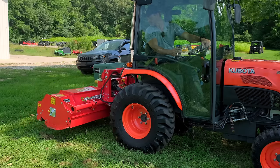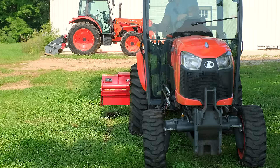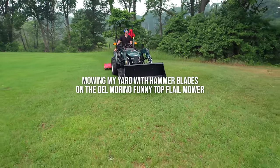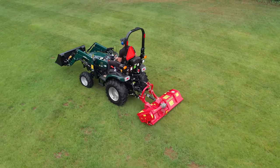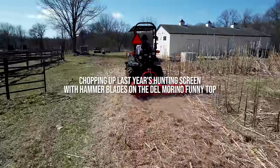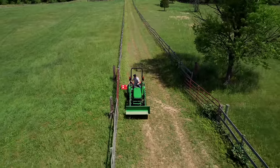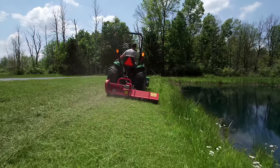One of the big decisions when buying a flail mower is whether to get Y blades or hammer blades — I've done a video on those differences. Traditionally, you'll hear that Y blades are for grasses and light weeds, while hammer blades are for thicker, nastier material like brush and small saplings. But I've found hammer blades work really well on grass too, and if I were going to pick one, I'd lean toward hammer blades — they're more durable and robust. They did a nice job on my lawn, and I know I can still tackle the field and brush line with them. You can always swap blades out; it takes a couple of hours since each blade is bolted on individually. And if you break one off, you only have to replace that one blade.